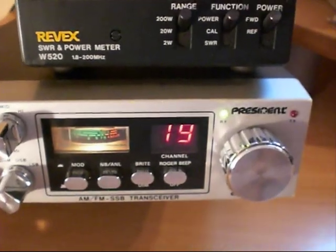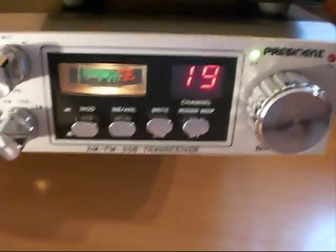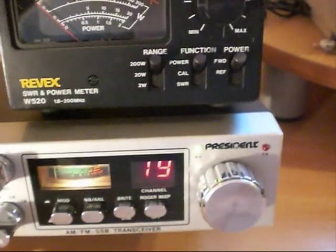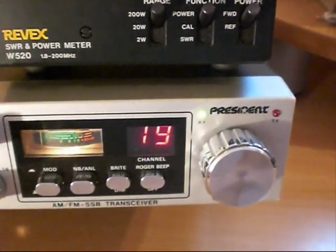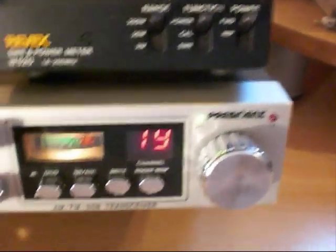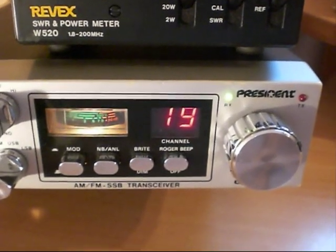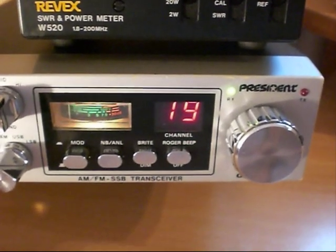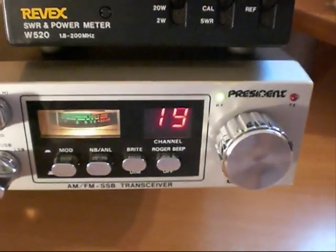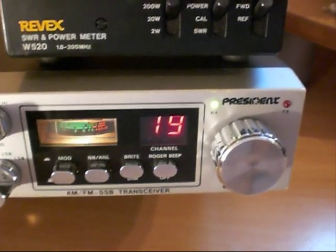So there we have one President Grant converted from 2SC2312 finals to IRF520Ns. Now a lot of people have asked me about gate voltages — some people have tried these kind of mods and don't seem to get very far with it. Well, the gate voltages on these are set to 4.2 volts, and that's what they're set to at the gate: 4.2 volts for both of the finals. Obviously you want to keep the current matched if you can, to get it running sweet.